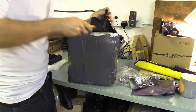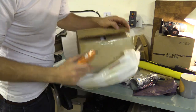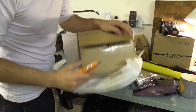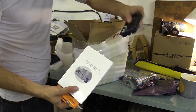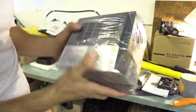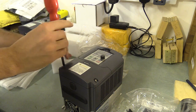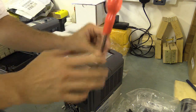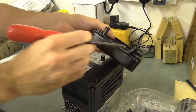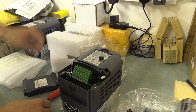I'm now going to explain how I wired the VFD and programmed it to power the spindle. The full story is a little complicated as I received these items from two different companies which I had decided would unwillingly collaborate. I took advantage of a lot of misinformation until it backfired, making this stage last a little too long. This VFD is manufactured by a company called NF Lixin, and there is very little secondary information about it compared to say the Huanyang VFD. Upon examining the instructions I noticed the wiring diagram didn't correspond with the VFD I had asked for, and I refused to use it because I could not find an earth terminal.